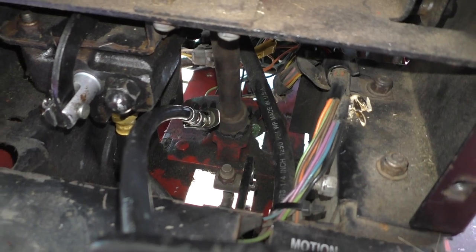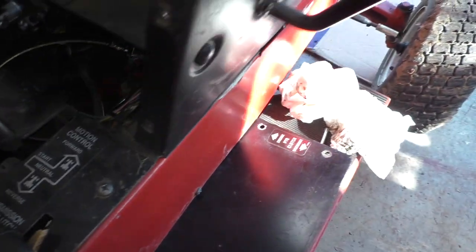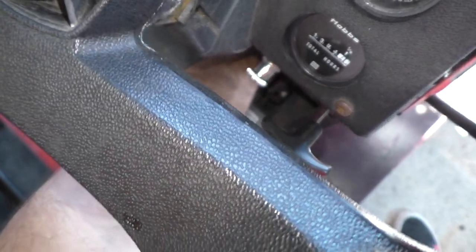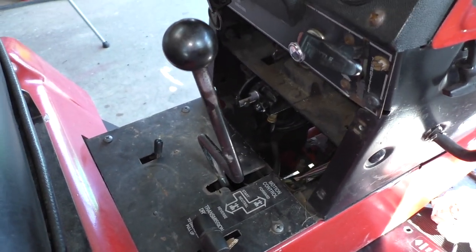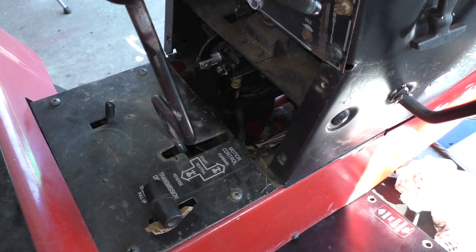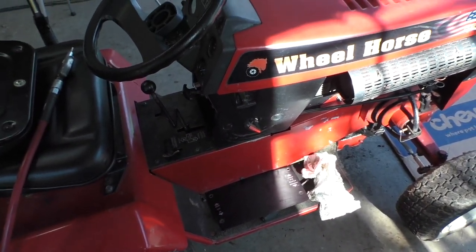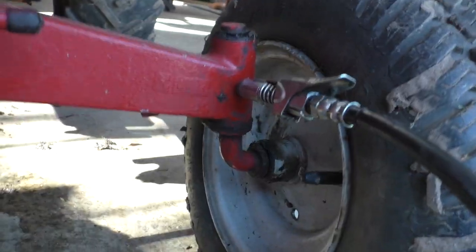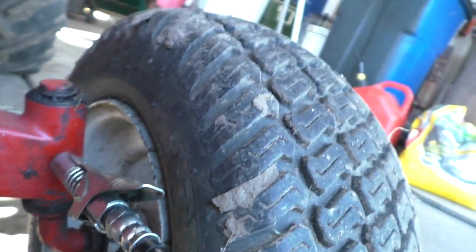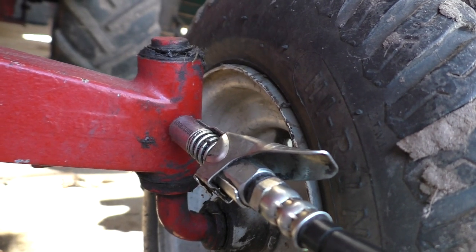A lot of people don't know that there is a grease fitting down in there, and that fitting probably sees absolutely no work. Take off that side panel right here. If you have a 417, a 413, 520, or 416, you've got one. Make sure you take that off and get down there and grease it. It's sure a heck of a lot easier if you've got a Lock-n-Lube. They don't sponsor me, but I just love the product. Don't buy the Chinese knockoffs — do not do that.